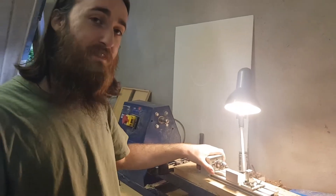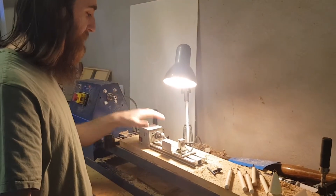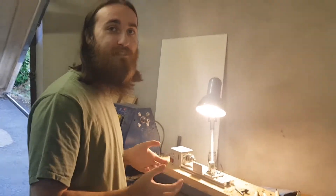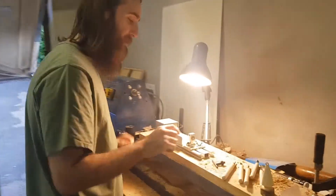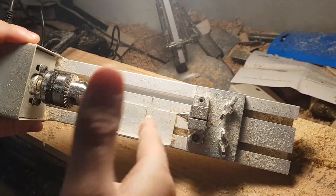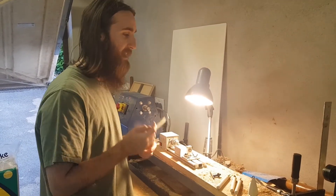All in all, it's a piece of shit — as I expected. The tools are awful, unusable — wouldn't even bother, kindling. You can make this work but it's such a faff. We had to do so many bodges and even just moving the slightest thing is a disaster every single time. The lowest speed was definitely fast enough — any faster than that and it was just throwing the piece off. The tool rest is really thin and way too far away. The notch in this for the screw doesn't come any further, which means you can't push it any further forwards towards the wood. That's probably the biggest thing because it means you're always overextending and that just throws the tool out of the way.